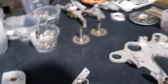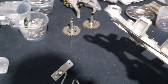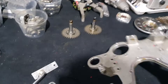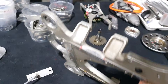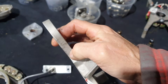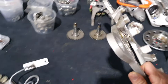I'm not overly convinced about the casting on the engine plate being the same thickness as the billet. Billet material is really strong because it's solid and has good grain structure. Casting is not the same, and I've already seen some little signs of bending on some of these ears on some of the Gen 4s. That's definitely something to keep an eye on. If we're shifting to a casting, it would have been nice to make it a little bit thicker to avoid it getting bent or even breaking. But time will tell - as a casting, it's pretty thin for an engine mount.